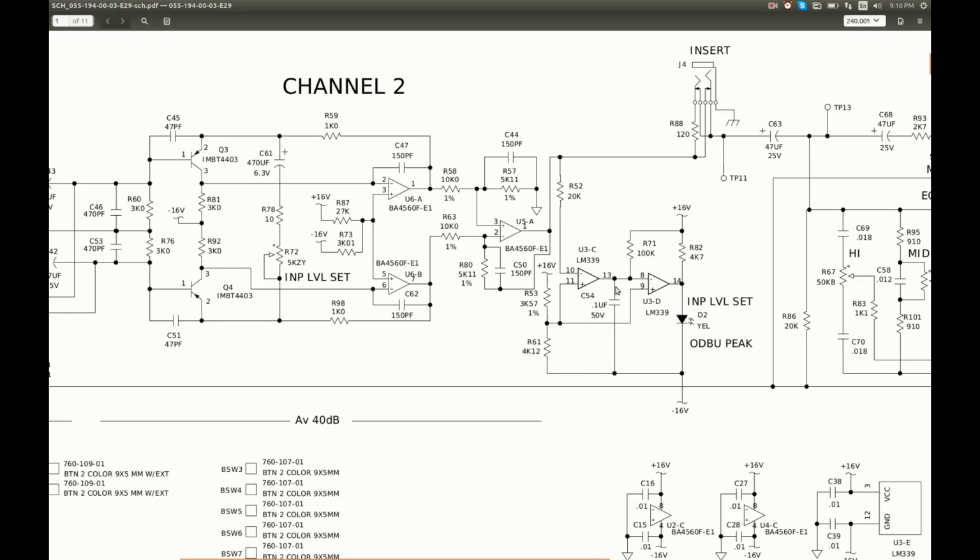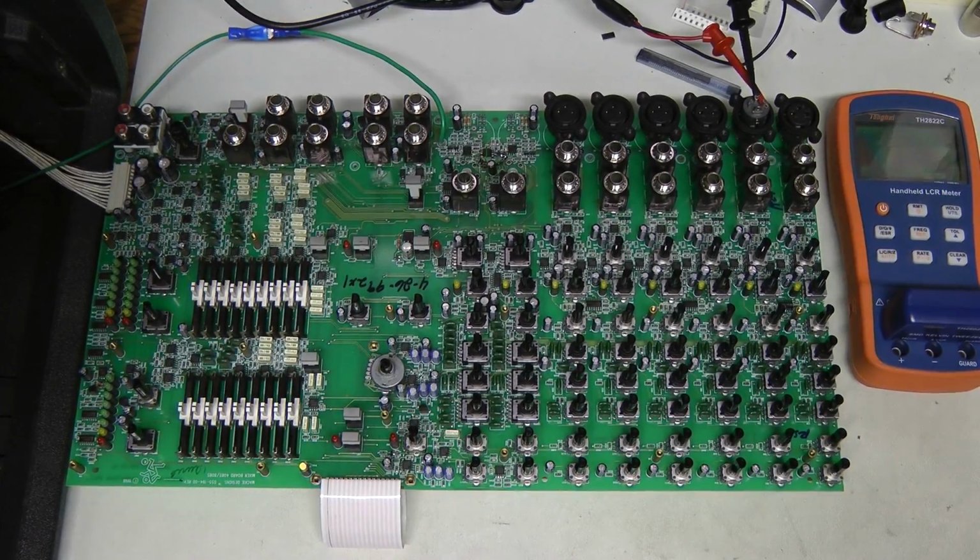And I think I checked both the resistor and capacitor in circuit, and at first glance they look fine. So I'm not sure what's going on. Maybe I should just replace them, because it's easy, and see what happens. I started with the capacitor, I replaced it, and the problem is gone.